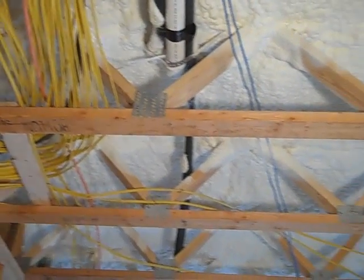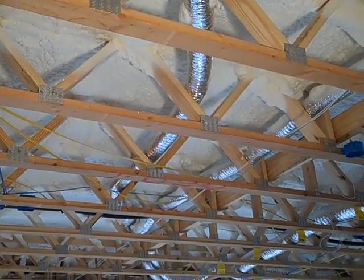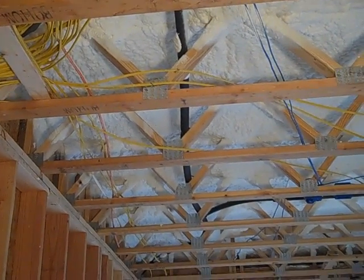Let's walk out to the garage area — I want to show you the ceiling. We're in the garage of this house — it's a two-car garage bay. Above us is a bonus room, basically the client's media room upstairs. This roof in here has been spray foamed. It's often done with fiberglass in houses under construction, but fiberglass is going to fall over time and it's really hard to get good continuous insulation — so this is a perfect application for spray foam. This house has two types of insulation: Owens Corning Energy Complete on all the walls, six and a half inches of open cell spray foam in the attic areas, and three-quarter inch of rigid foam on the outside — making a very tight, comfortable house with a thick insulation blanket and no gaps.